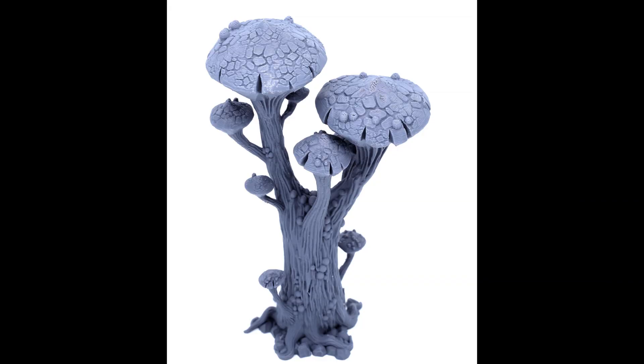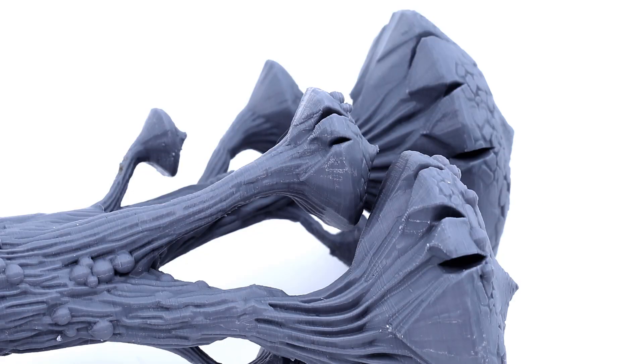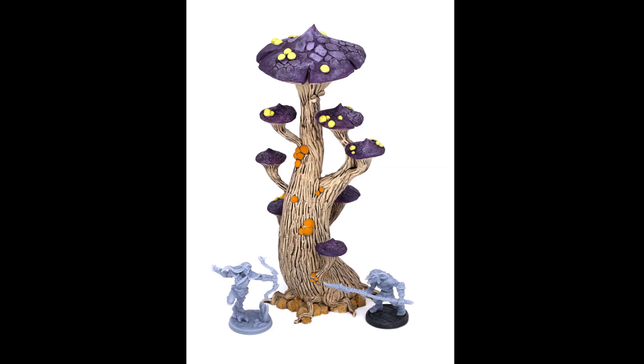Looking at the 50-degree version from the top it still looks fine, but from the underside you can see those huge triangles of material - to me this ruins the model, I actually threw it out. I just printed it to show you how it really does sculpt on extra material to the angle you set. Here are the ones printed at 80 degrees and they all look great. I hope this makes your prints and overhangs come out better - please like, subscribe, and check out my other instructional videos.